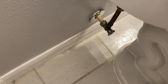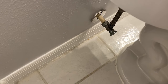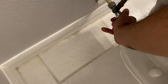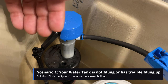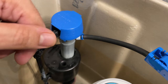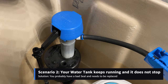Before starting any work make sure that you turn the toilet valve off by turning it clockwise. Mine is just a quarter turn valve but it is probable that you must turn it several times clockwise for it to close. In most cases there's a problem with the top section of the fill valve. In the first scenario a mineral buildup is preventing the water from coming in. In the second scenario the seal inside this mechanism has gone bad and it's not stopping the water from coming in, so you will hear your toilet running all the time and you will be wasting a lot of water.